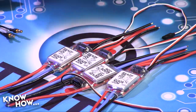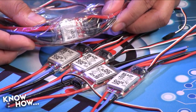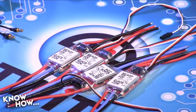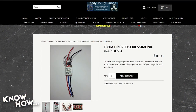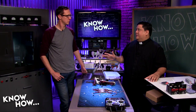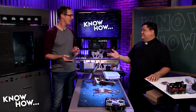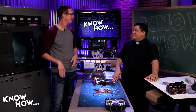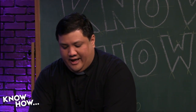The 30-amp ESCs may be slightly heavier but are much more robust. Unless directly impacted, they're basically going to be fine. Buying at this level means room to grow — if you limit yourself to a 20-amp ESC and later want a bigger motor, you have to buy new speed controllers too. The ESCs have bullet connectors, which means you can swap them in and out like Lego pieces without cutting and re-soldering.